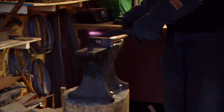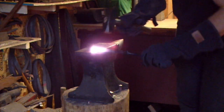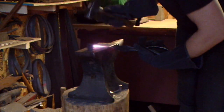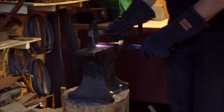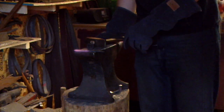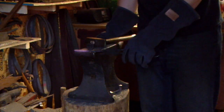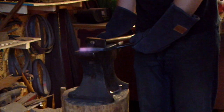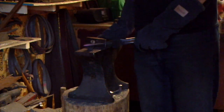We've got a rough outline of where the tang is going to be and will refine it on the next heat. Keeping control of the steel can be a little difficult with tongs or pliers. You can use vise grips — that way you don't have to keep the blade firmly clamped with one hand, which can get fatiguing over time. That's one little thing you can do especially if you're doing a larger knife blade and forging for a while.